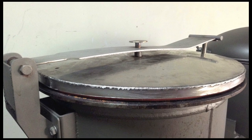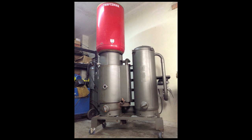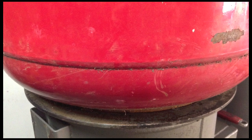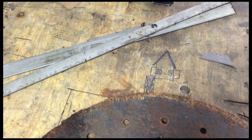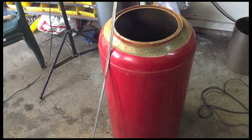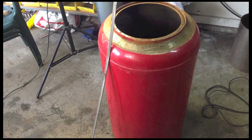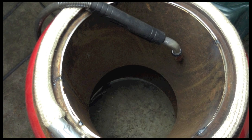Now I'm going to take the lid off the reactor because we're going to reuse that in a minute. Here's kind of a test fit of what it's going to look like. Once I have it set on, I can start sizing up my gasket channels. I'm using some flat bar — I'm going to roll it up and weld it on. If I'm using one inch fiber rope, I might put a three quarter inch gap.